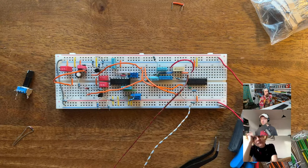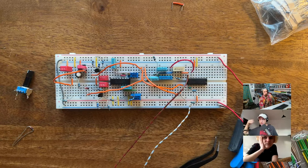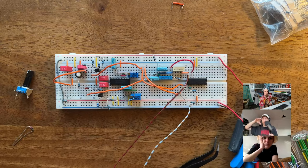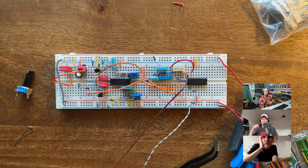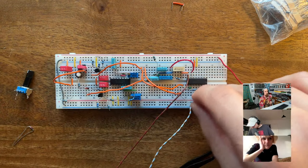I mean, it's a sine wave, but it's also kind of not a sine wave, because it's really interesting. They abuse an NPN transistor as almost a voltage controlled resistor, but it's messing up the waveform when they use it to do a little bit of a pitch envelope at the beginning. When that's active, it deforms the waveform in a weird way, so it's not a sine at that moment. It only is a sine after it goes into the bass pitch, basically. Okay.